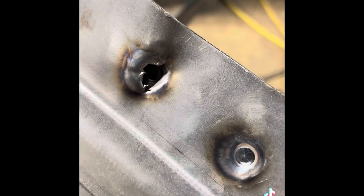That's the kernel that it left, which is far superior to the kernels on the truck from the factory. As a destructive test I did three welds and hammered a chisel down inside of it, and you can start to see it's tearing the parent metal and pulling away from the spots before it wants to break the spot.